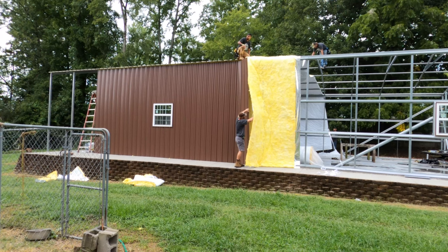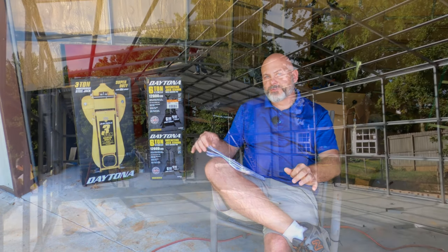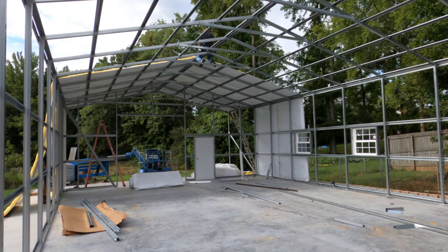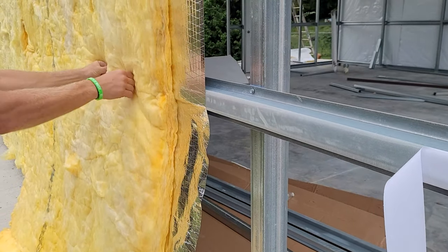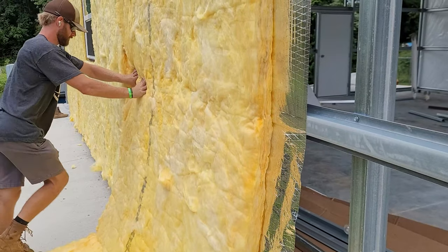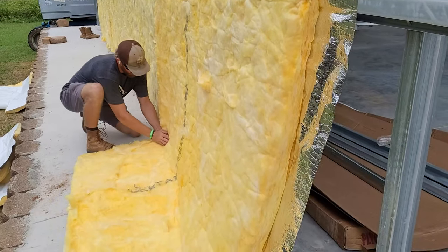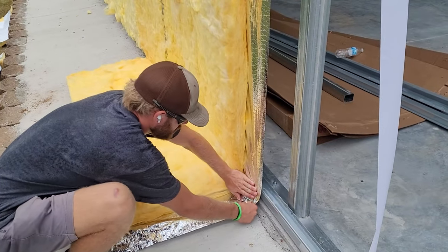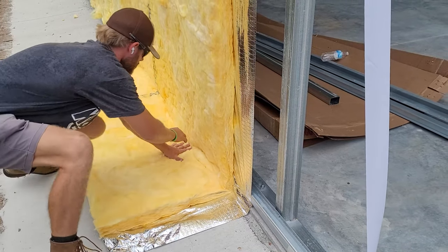Now you've got insulation centered over the ridge, draped over the building and down to the ground. Your ground folks are going to grab the insulation and pull it just enough to remove the wrinkles — you just want it flat, not under a lot of pressure, as that will cause it to tear over time. At that point, peel back enough paper off the tape to stick the insulation down and press it in very firmly on both sides. Then cut off the excess at ground level.